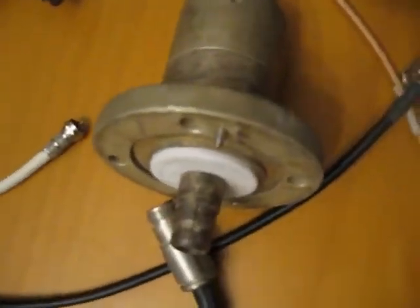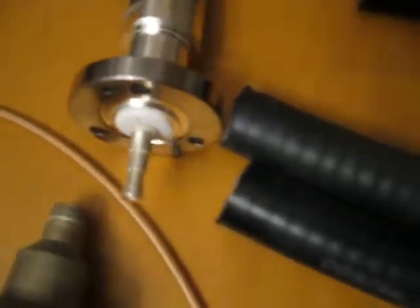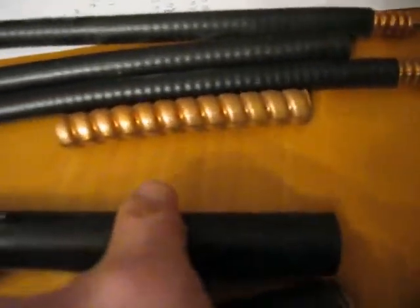Typically, the flanges go with the same size of cable. However, there are a number of flanges that have different capabilities. So you might have a 1 5/8" flange for a transmitter that's got that output, but you only use a 7/8", for instance, cable, or vice versa. There's a number of different variations, and it's always good to make sure that the manufacturer of the connector is the same as the manufacturer of the cable, because not all companies' cables fit the connectors of a different company.